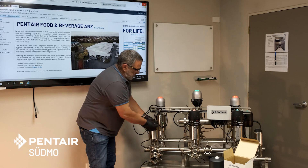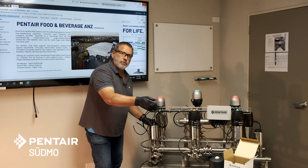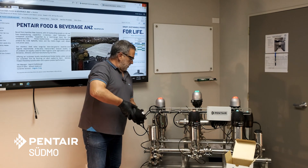I've left this gasket in place. If we were servicing an explosive area — IEC EX or EXI intrinsically safe — we have to replace all gaskets. So we'll do that, and here's our replacement top.